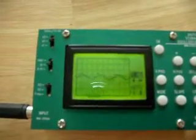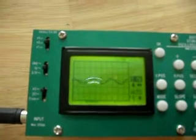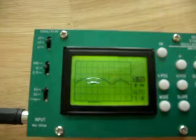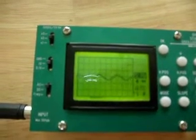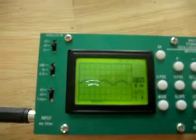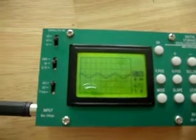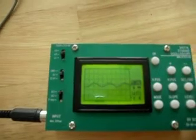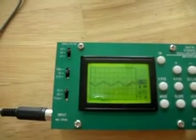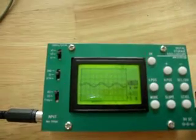On this scale we're showing it's probably 1 volt peak to peak. This scale is 1 volt per division. As you can see, this waveform probably occupies 1 square in the vertical direction. So it's a 1 volt peak to peak sine wave that we've got.